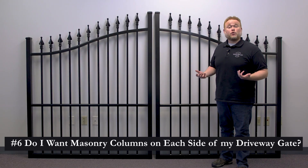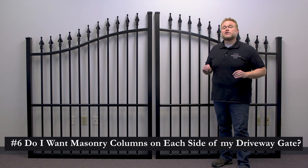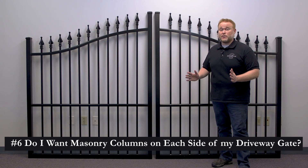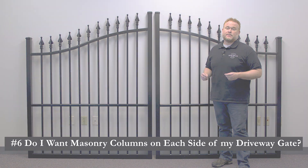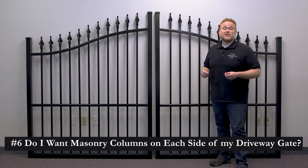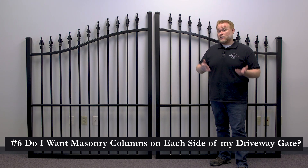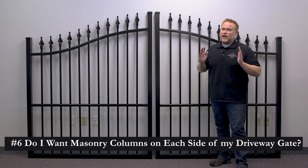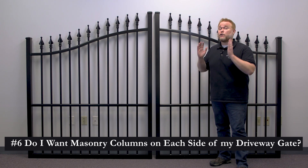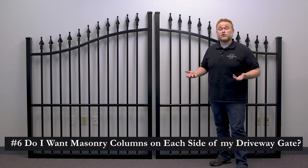Final question number 6 is do you want to incorporate masonry columns with your gate? We could probably do a whole video on what to consider when using stone, stucco, or brick masonry columns around your driveway gate. However, let's just touch on it briefly here, as it's something to ask yourself before you build the columns or buy the driveway gate. A lot of people love the look of masonry columns with driveway gates — it's a stellar look. However, the biggest issue I see is that folks build the masonry columns first and then go gate shopping. They then find out that a 16-foot gate does not fit the 16-foot opening they built between their columns. I cannot stress enough: choose who you'll be getting the gate from before you build the columns. Every manufacturer varies a bit in what's required to fit their gates with posts and hardware — you'll want to know that measurement before you start building those columns.